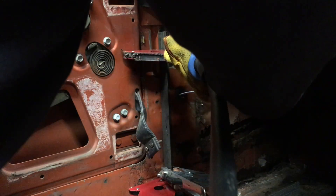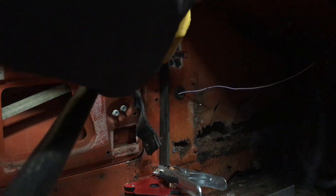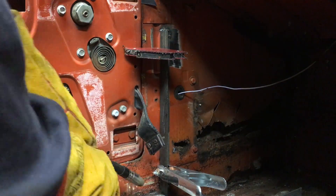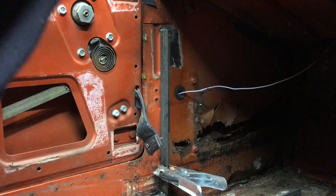I'm tacking in the first bit of the bracing structure at the bottom and at the top. What I decided to do for the bracing was one bar across the door down to the chassis member. Later on I braced widthways and also installed rear wheel arches and plenty of triangle structures to keep the strength as I cut out the sills and cut out the chassis members.